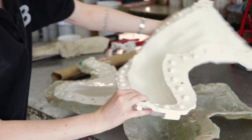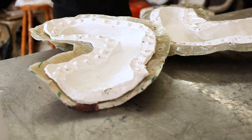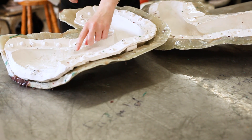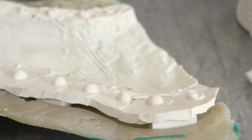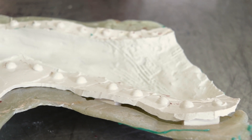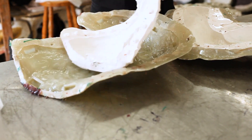The first layer of rubber that we put onto the object, onto the sculpture, is really thin. It's really crucial that we pick up the finer details of the works, like these bits — they're the artist's touch on the work, so that's really important for us to capture. Then we back that with two more layers of silicone, which makes it this thickness, so it's nice and robust.